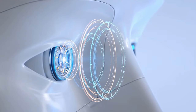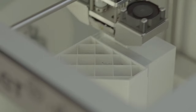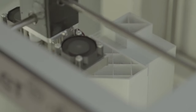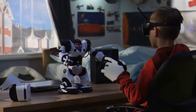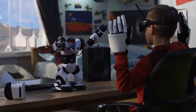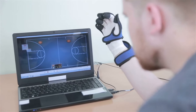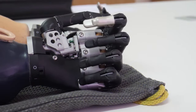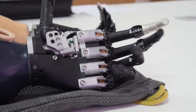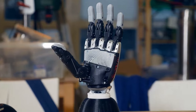After customization, the user identifies locations for tactile sensors. These sensors are integrated into a knitted glove that fits securely around the 3D-printed robotic manipulator. The glove is comprised of two fabric layers — one containing horizontal piezoelectric fibers and another with vertical fibers. Piezoelectric material produces an electric signal when squeezed, and tactile sensors form where the horizontal and vertical fibers intersect, converting pressure stimuli into measurable electric signals.